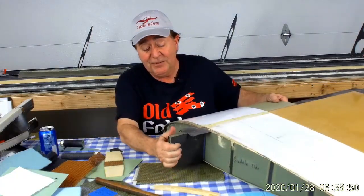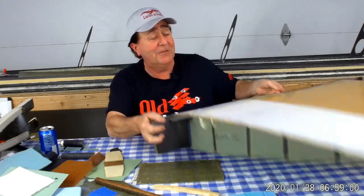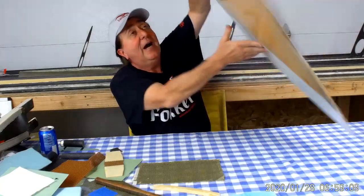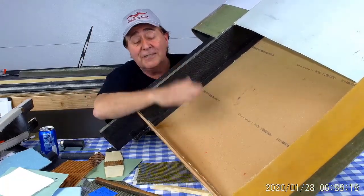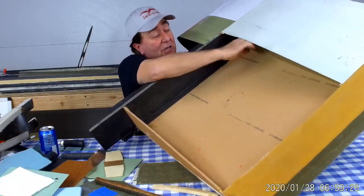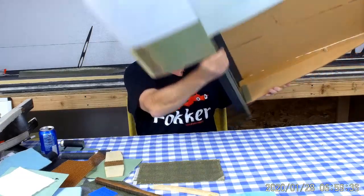How do you make the spar, build it up flat on a bench, and get flanges on it so you can put a cap strip on? How do you put cap strips in? What does the trailing edge look like — is it carbon fiber on the inside? I've got fabric covering, I've got skin. I went through a bunch of different stuff. The inside is a single skin on the outside with nothing on the inside — foam rib, unique structural processes. Fiberglass over very thin Airex with nothing on the inside doesn't hold the shape well enough. Most of this was playing around figuring out what would work.